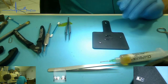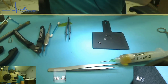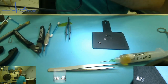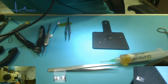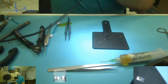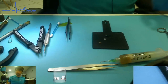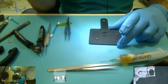Now, the tip I just used, I don't really like that for things that are not pad repair, I should say. So pad prep. Oh, that's hot. I don't like to use that one. I use my KN tip. My T30 KN. Turn that back on. And what we're going to do is get some fresh solder on these pads.